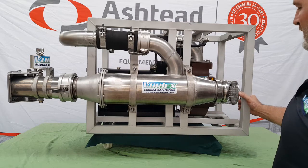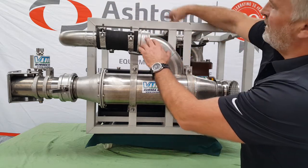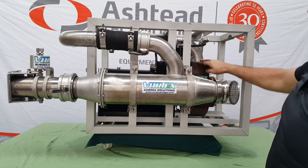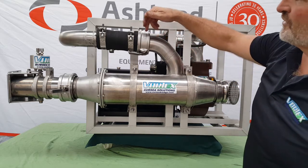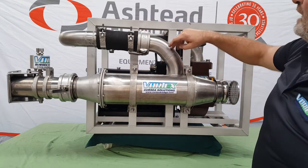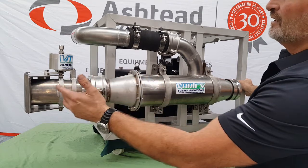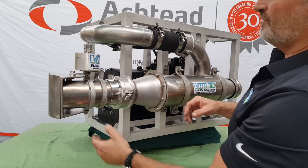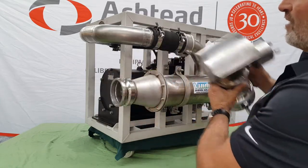Same as with our other hydraulic dredges — when in the frame, we've got a U-Bend here. Just unclip the cam locks, take the U-Bend off, and then you can remove the Venturi and/or the pump if you want to put it in the modular system. You can then use the 3-inch hose to join up the Venturi if it's going to be some distance from the pump, and join the two up wherever you like. With the reversing valve, same as before — you can go directly onto the exhaust end of the Venturi, or remote mount it and put it somewhere else on the ROV.